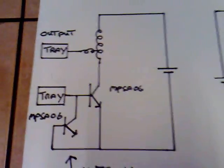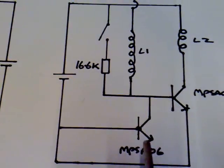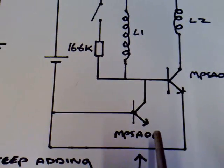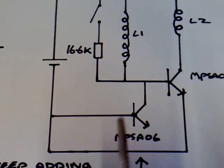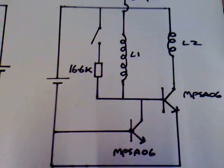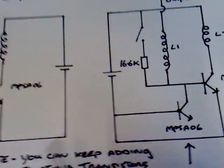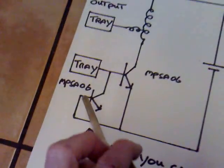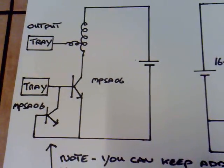This is Slayer's exciter circuit and I've done the same thing here — I've put a transistor in, left the emitter floating, base to the negative of the battery, and the collector going to the base of the standard transistor. This is reducing the consumption considerably. The interesting thing is you can keep adding these transistors in and the current consumption comes down every time you add one.